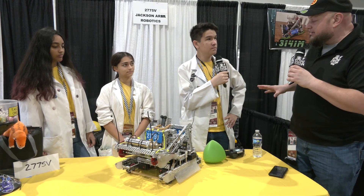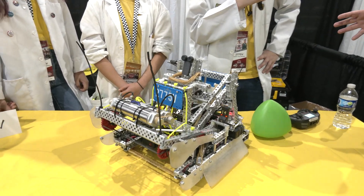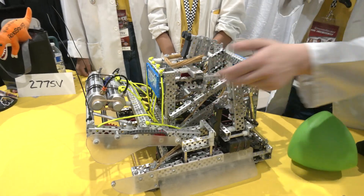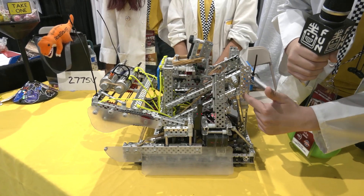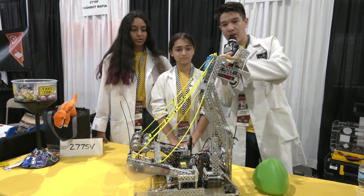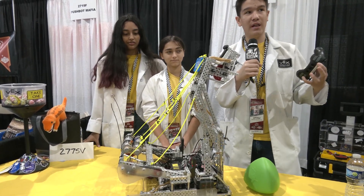We've got a lot to unpack in this robot, but let's start with the huge multi-function lift. It's a four-bar lifting mechanism with an offset linkage, mounted in a way that it tilts back a bit. At the very top it has a pretty large tilt, giving a higher angle to allow shooting over opponent blockers and providing a good grouping on the other side of the field.